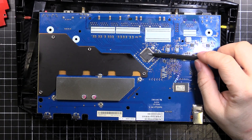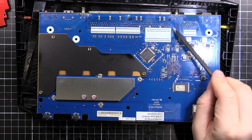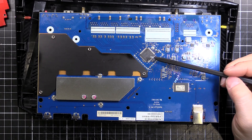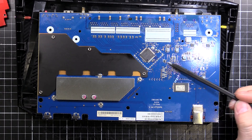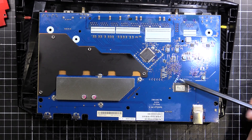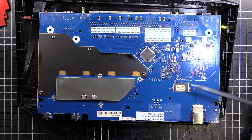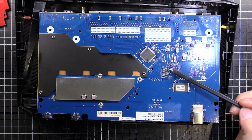That's not a processor — that's the 4-plus-1 gigabit Ethernet switch for four of the ports, an RTL8365MB. Then there's another four ports that must go somewhere on the other side under the can. You can see all these little groups of capacitors. On the other side of that is where the main processor will be, like an ARM processor. Those are the decoupling caps and you can see all the traces coming in. That's the flash RAM — maybe 8 meg or 16 meg, just the flash memory. And there are a few power supply inductors — six of them — doing the various voltages.